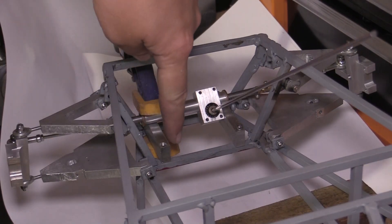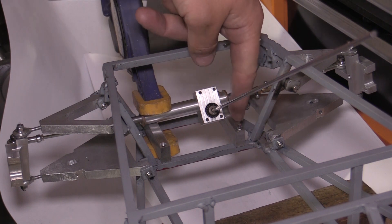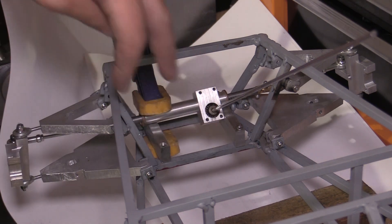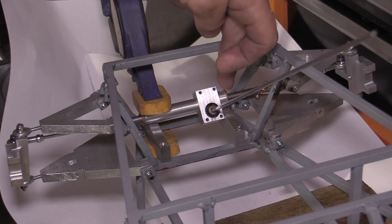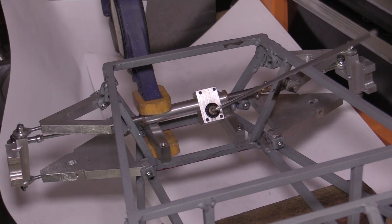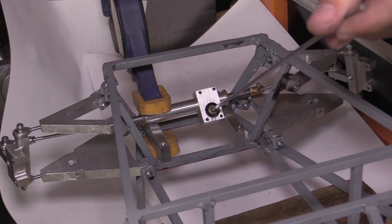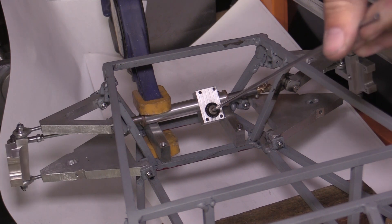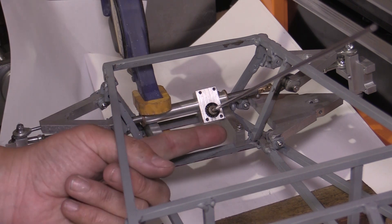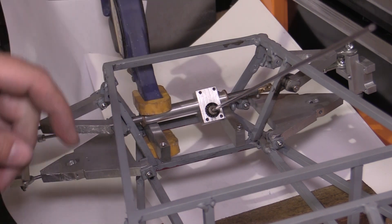I've now got those two supports machined. I've counterbored this one on the left and I'll probably do the same to the other - I did it because I didn't have any screws long enough to reach the tapped holes. I've got them in position and now I need to work out where I want to put the holes for the clamp for the steering rack. I've got it in a position I like, and you can see the uprights turning when we turn the rack. I also need to machine a small recess into that side - just for the casing of the pinion - about 2mm.